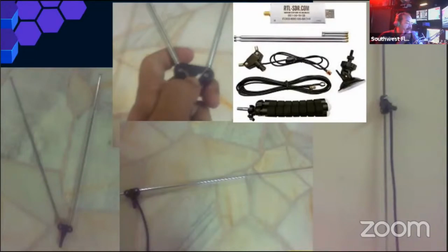So that's kind of ingenious. Any pair of rabbit ears can be, and all you got to do is find continuity between your positive leg on your wire, so you know which one is the positive, because you obviously want the center conductor to go to the upright antenna. If you figure any pair of rabbit ears can become a tunable dipole antenna, I caution you not to use more than 5 watts with something like that.